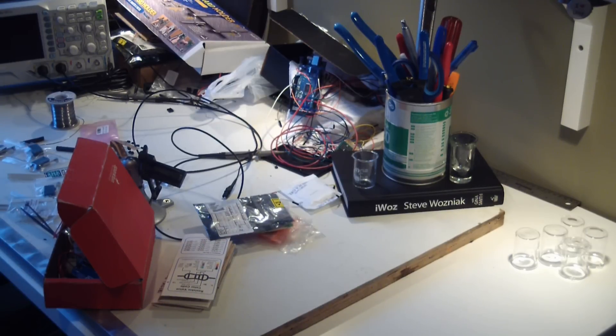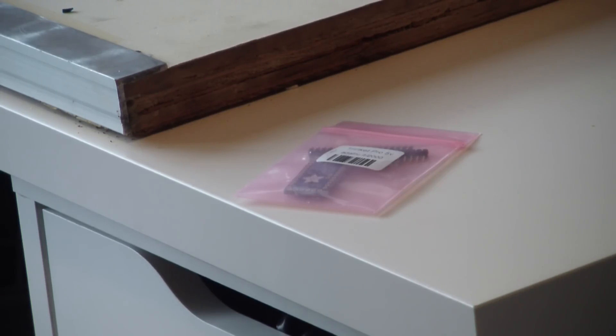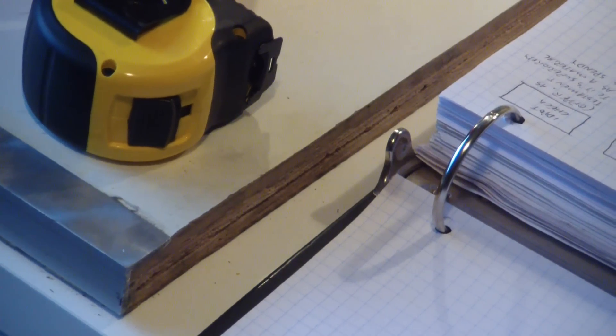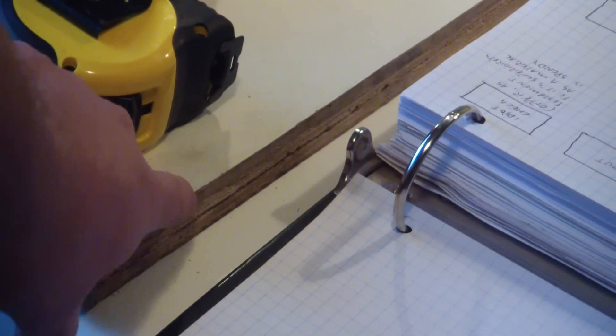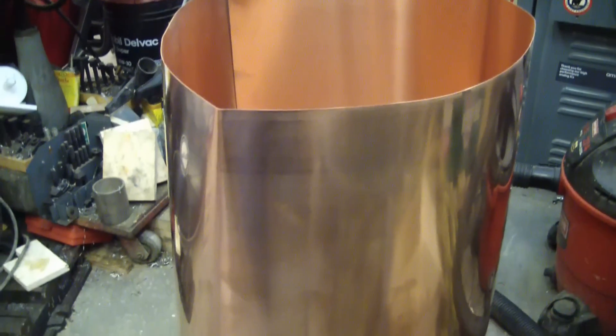I'm gonna go ahead and take care of a little problem I've been avoiding, and that is static discharge. The new desks don't have suitable work surfaces for actual work — veneer in Scandinavian actually means onion skin paper, and that is what they surface their desks with. The easy and sensible way to protect ICs while you're working on them is to use a static dissipative mat. However, I prefer the difficult and ill-advised way, which is providing a low impedance path to ground. ESD matting, being rubber, off-gasses, fades in sunlight, and is unpleasant tactilely. I've decided to eschew conventional wisdom and go with a conductive work surface.